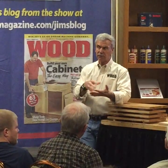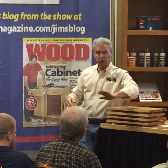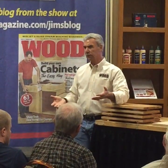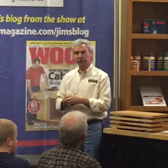So now you're stuck with that spot. Am I going to stain a little bit of one and then maybe not the other, and then put a stain over the whole thing and see if I can make them more consistent? You're fighting yourself the whole time. So the consideration here is, if you're building a small project, try and find the red oak or the cherry or whatever that has the same general color. So when you're putting that project together, at least you're starting out with something that you can work from, okay?